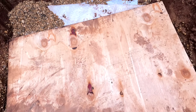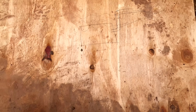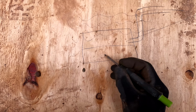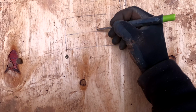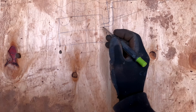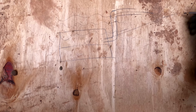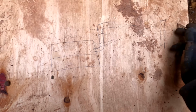So just to let you know exactly what we're doing, I've done a very technical drawing here. So what we've got in here are 2 rows of crates. So this is the bottom crate and the top crate. These are 400mm deep, so that gives us an overall of 800. Okay, so what we're going to do, this is going to be our inlet pipe into the soakaway, and our silt trap is over here, and then we've got our French drain coming in from over here.